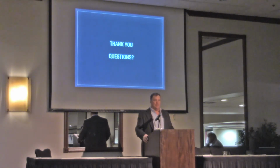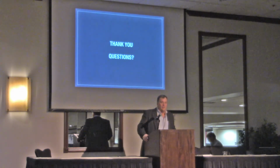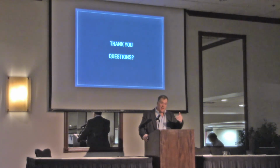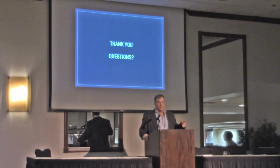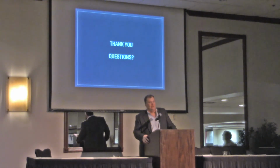I take it. I hear a lot of people say, don't take that, we won't have anything to nail to. Well, you don't need hoof wall to nail to, all you need is a white line. And it's already weak, and that's the way I look at that with the founder horse. I take it. I'm not saying I've been 100% successful with it, and I know what you're talking about, and I know your concerns, but it doesn't bother me. I hope that helps, but that's just the way I do it. That's all I can say.